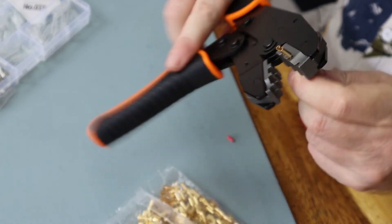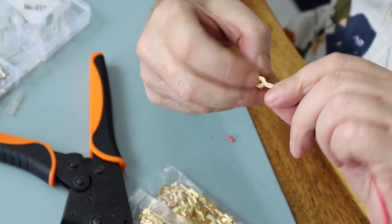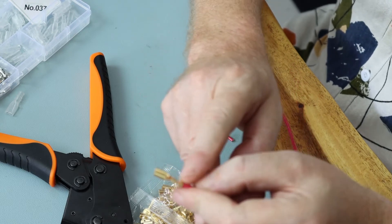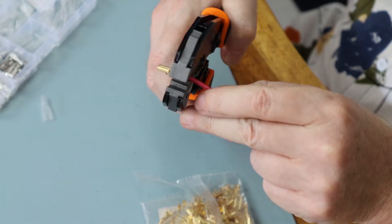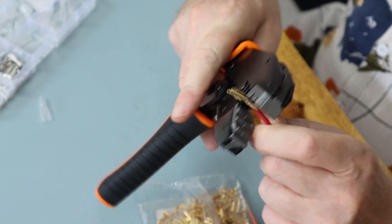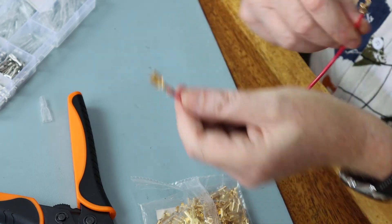Then we squeeze nicely like that and we get what I would call a perfect crimp. It bent this a little bit — these ones have got a spring on them for going in. I went in slightly too much with the wire and you can see the second strap went around. We'll do it once more, making sure the wire is not in too much. And yes, now there we have the crimp — it's about five millimeters that we stripped off the wire, and the band is going around here, which we would consider near perfect.